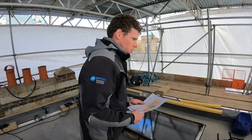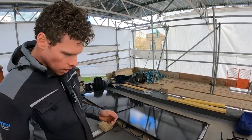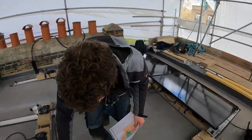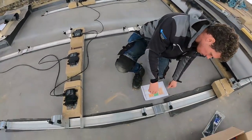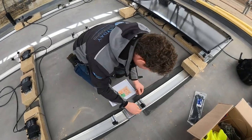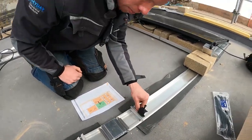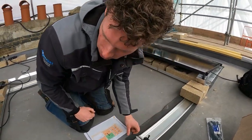There's no parapet wall on this side, so crosswind comes in from there — that's why we have more ballast here. We've got these rails that run along, with the bedding feet along here — there's a little rubber piece below, and these pins slide in, get knocked across, and lock in place. Our panels are going to fix to those.